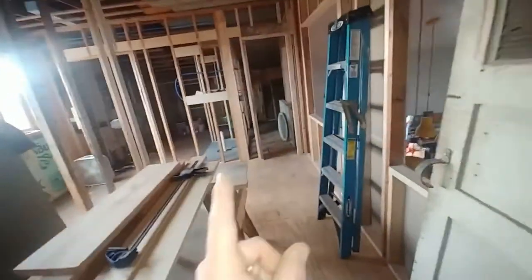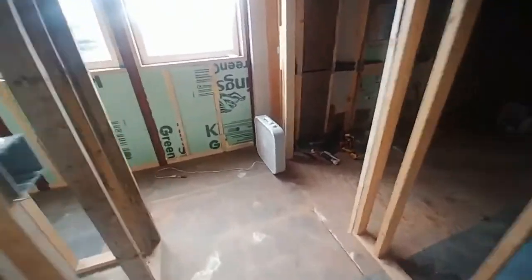I made all the 14 and a half inch pieces for full bays. He'll have to make all the unique ones, but you can just cut that with the circular saw. Don't put it through the table saw. It's too sticky. It has too high a coefficient of friction, and it also melts against the blade, and you can get a pretty rowdy kickback from putting styrofoam through the table saw. But the circular saw does not trap it against any fences, so it's fine to do.